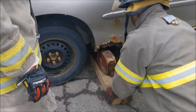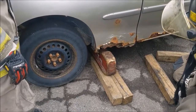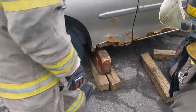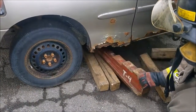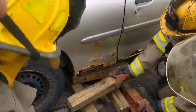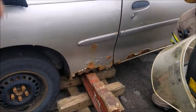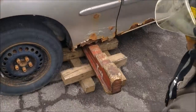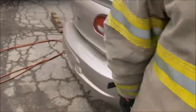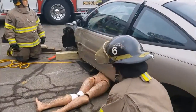Generally they say you don't want to stack two things in the same direction, but the one time you can is with a step chock when you're just trying to catch a little. That's all rusted out, so it might not do much for us as we lift. Once you get that going you could put it on top of there and feed it in. I don't like sticking my hands under there either — always try not to put your hands anywhere near a pinch point. In a real quick lift where you've got to get this person out right now, this is something to consider, but chances are you'll have enough room to work safely.